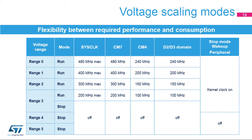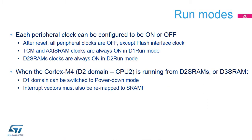The internal and external oscillators, as well as the PLL, can be used in all modes respecting the maximum frequencies. The run mode range is determined by the system clock frequency, even when a CPU is in C-stop mode. In stop mode range 3, the peripherals with wake-up from stop mode capabilities — UART, SPI, I2C, and LP-TIM — are operational. In stop mode ranges 4 and 5, peripherals with wake-up from stop mode capabilities are disabled. Each peripheral clock can be configured to be on or off in run and low-power run modes. When running from SRAM, the flash memory can be put in power-down mode and the flash clock switched off. Interrupts must then be mapped in SRAM using the Cortex-M vector table offset register.